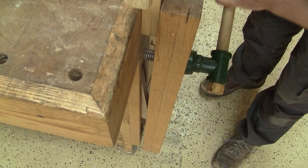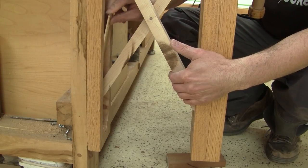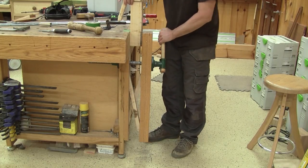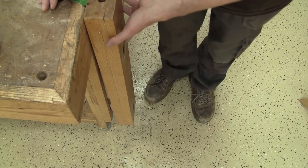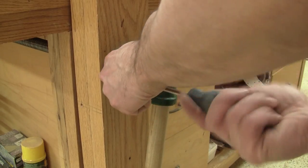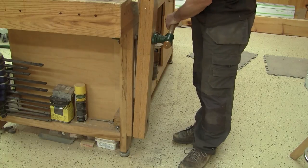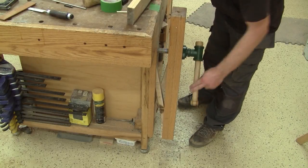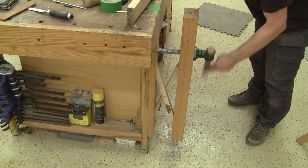This is the first try — it's not what I've been hoping for. I'll add some shim on the bottom of the criss-cross and try it again. It's better, but the chop is awfully crooked, and everybody can see that the wood has too much spring in it. I have no choice — I reassemble it. Well, this works, but I need to do something to stop this flexing. If I look at my new leg vise, the cast iron flexes a little bit, but nothing like that. Besides this, everything works. I'll need to do something one day to make it better, but this will have to be in another episode of the Woodpecker.